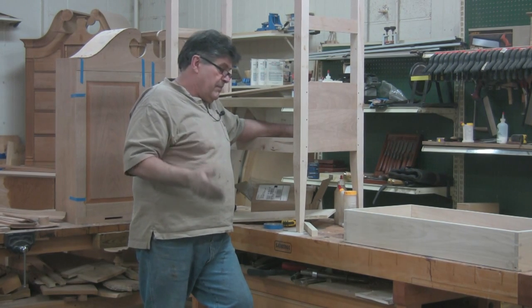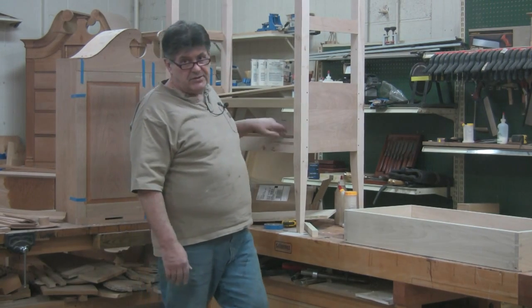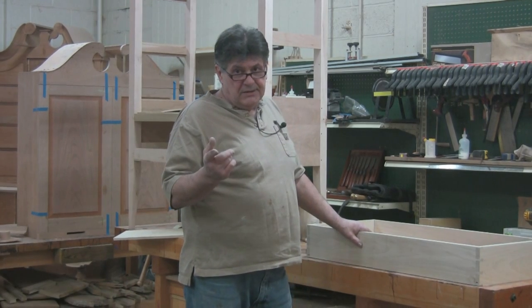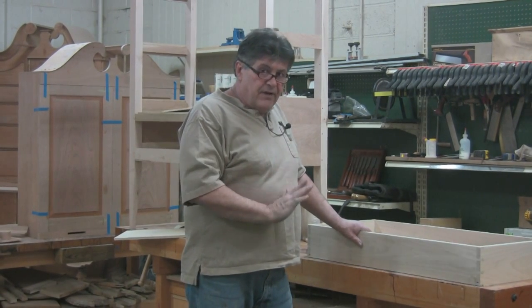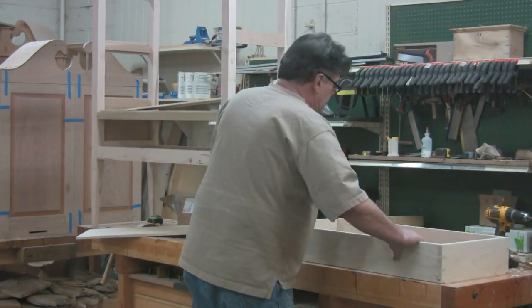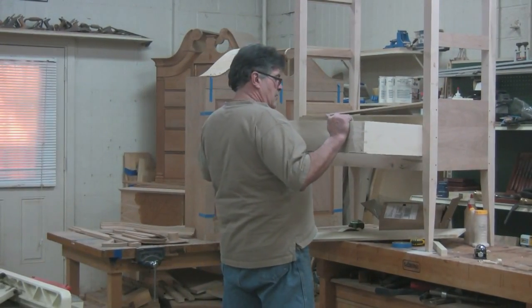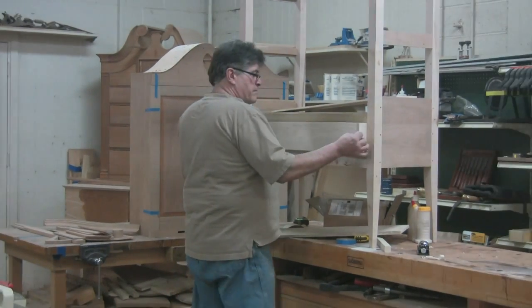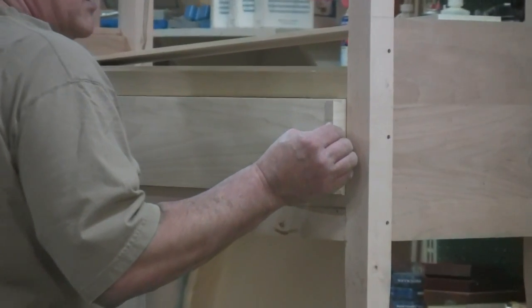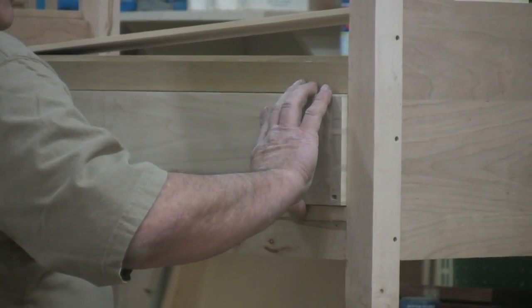You know, if you wind up having to glue a little shim on the bottom because you have to hand plane a little much, it's not supposed to happen, but it does. But again, it's not affecting what will be our final drawer and the final appearance of the drawer. All right, let's see what we've got here. Now, I don't have any guides in here, so I've got to wiggle to get the back between the posts back there. We'll get some guides in a minute.